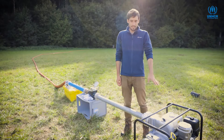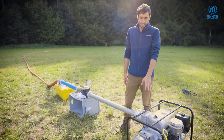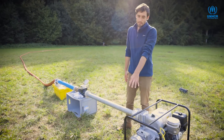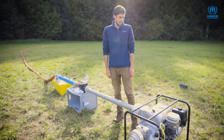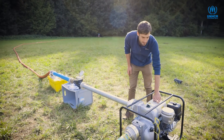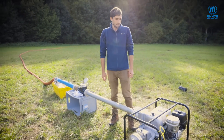It's really important with this type of suction pump to make sure we fully prime it before use — the chamber and the pipeline coming up from the borehole must be full of water so it can start properly. Also, before a test starts, we need to make sure we have enough fuel to power the pump for the entire expected pumping duration.